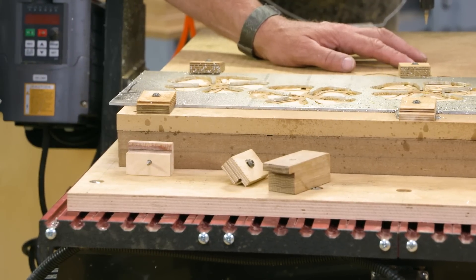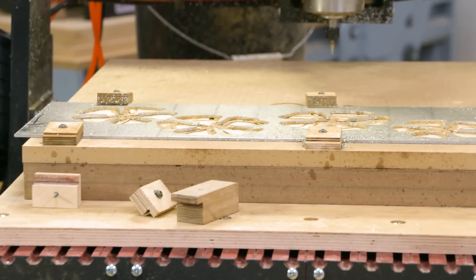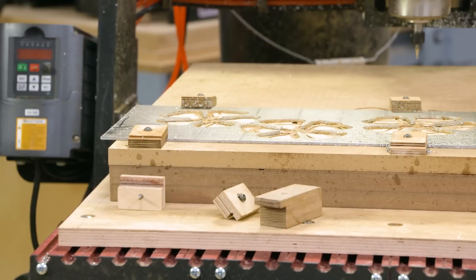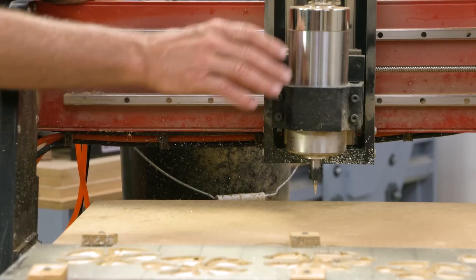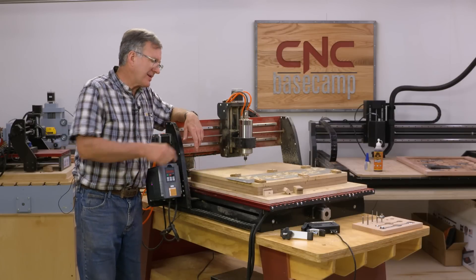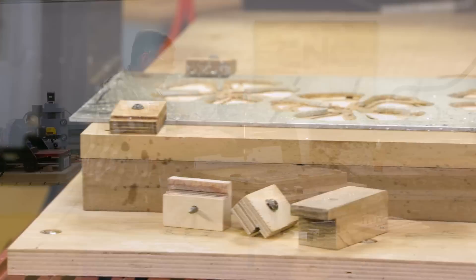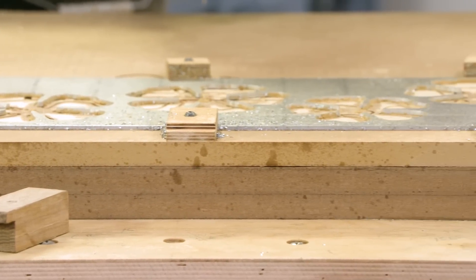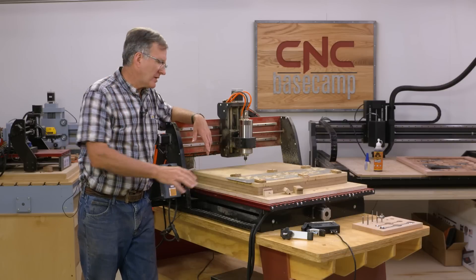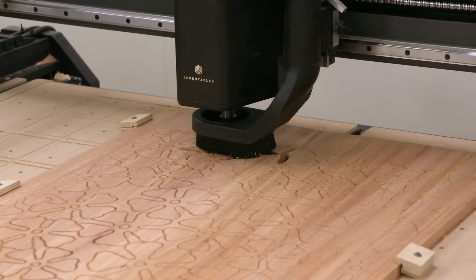You'll notice I've got quite a few layers here — yes, that does cut some of the Z-axis height down, but I use my machine a lot for pretty exact, high-tolerance work. By creating a thicker surface, I'm elevating the work closer to the rails on the gantry, which cuts down some of the lateral forces and makes things a little more accurate. It also gives me a lot of bulk that absorbs vibration and holds screws very well — my favorite being pocket hole screws, coarse thread, with that fantastic washer head. Give yourself some good options: keep one spoil board for woodworking and another for dirty oily work like cutting aluminum, so you always have the right system for whatever you're doing.